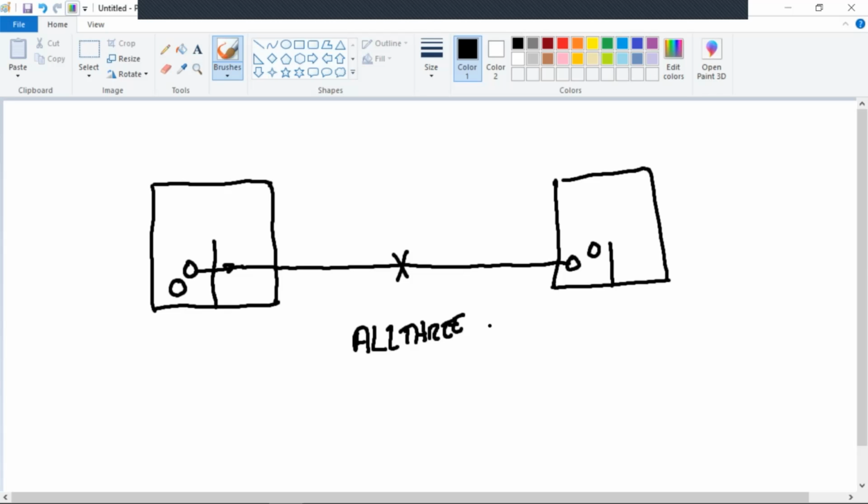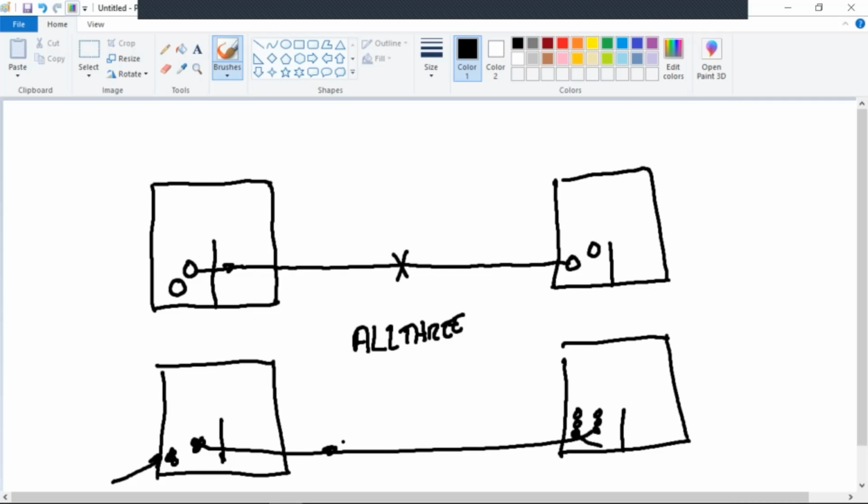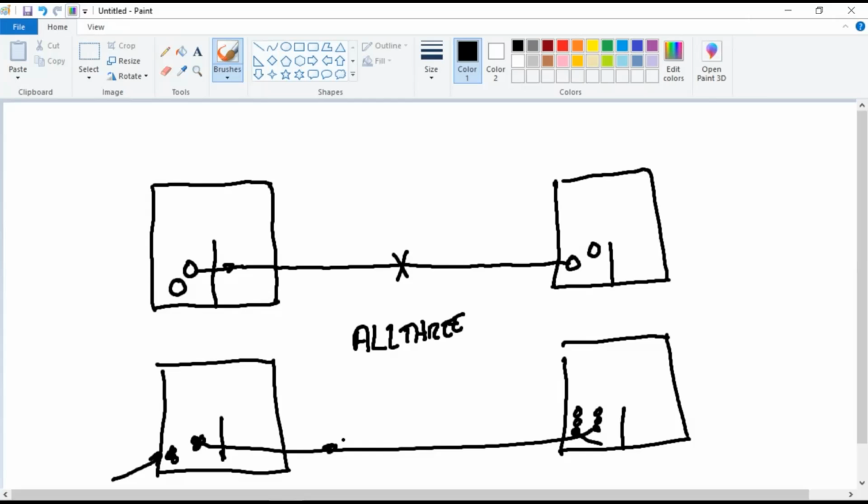Yep. So recently, and I know they did this, they did a cost analysis of this. What they're doing now is, we'll look down on the same two transformers from the sky. Now what they'll do is 1, 2, 3, 1, 2, 3, 1, 2, 3, 1, 2, 3. So I've got three separate inbound wires in conduit, three separate outbound, three separate inbound, three separate outbound. You have a failure of a phase in a conduit. What are you going to be doing now? Pulling one wire versus three. Pulling one wire out, one wire in. It's actually a cost savings that you're not scrapping the other two phases, compared to adding three conduits instead of one.